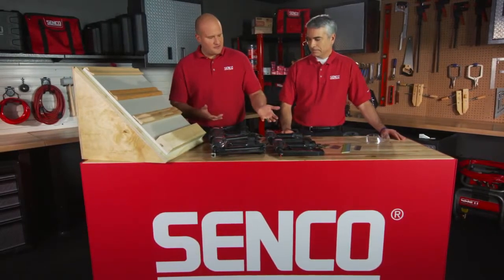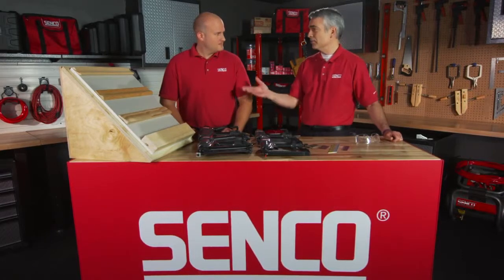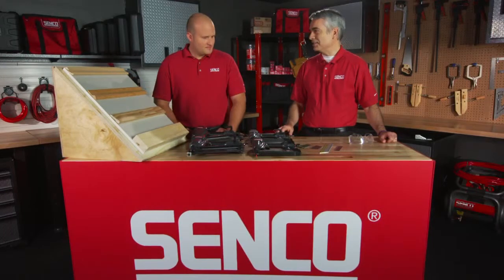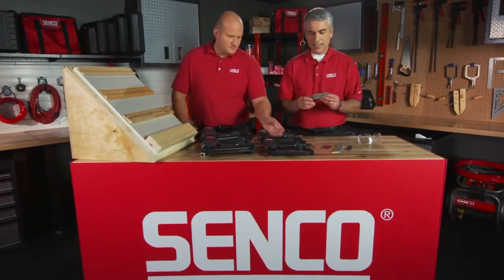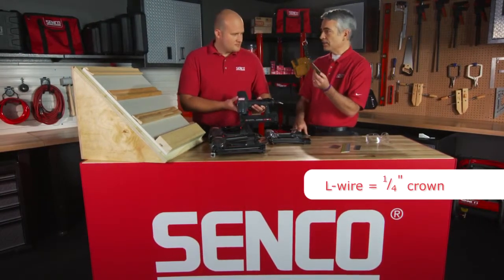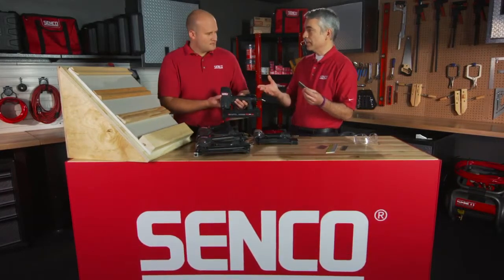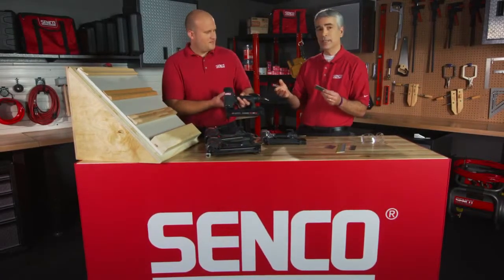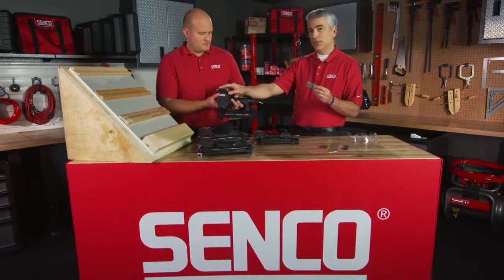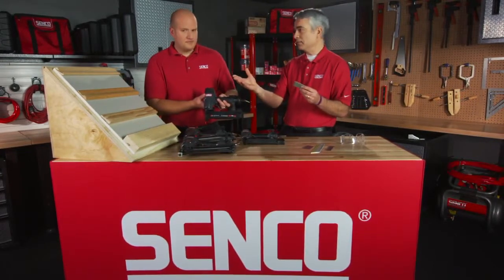Tom, we've got all these great tools and different applications. Tell me about the different fasteners that go in these tools and why you would use one versus the other. On the stapler — the SLS 18 — it shoots an 18-gauge L-wire staple. The L-wire staple is a glued process, and what we do in our glued process is keep our shear value down. One reason we keep shear value down is it's easier on the tool — when the driver comes down and picks off that staple from the rack, you don't want a lot of energy used for that. With a very low shear value, you help your tool last longer because you won't have wear on your driver blade. And all that energy the tool produces goes to what it's made for: joint connection. The lower the shear value, the more energy is transferred through the application to the substrate, connecting the trim or wood.